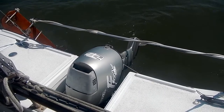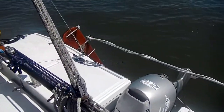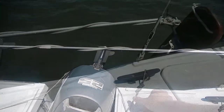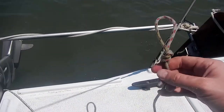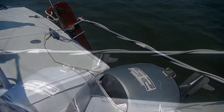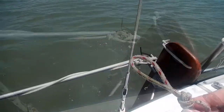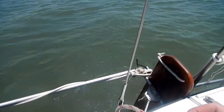It's good to note that if I get underway and want to pull the motor up, I can — the pole does not interfere with the motor at all whether it's up or down. To put the engine up for sailing purposes, I have to disconnect the engine's steering lines. The engine's steering lines gave me fits because they would come out of that little jammer and be super loose. So I tied a figure-eight knot at the proper location in each of these ropes, and on the rear hole I put these little double-ended clip hooks. When you put the engine up for sailing, you take it out of the hook so there's no binding, and that also gives you reduced effort on steering and on the autopilot.